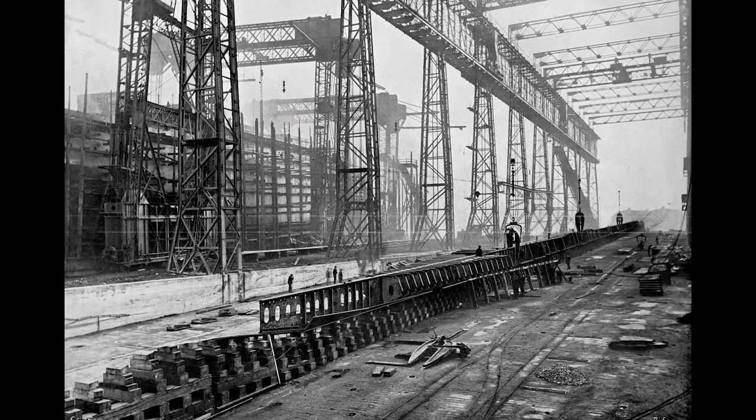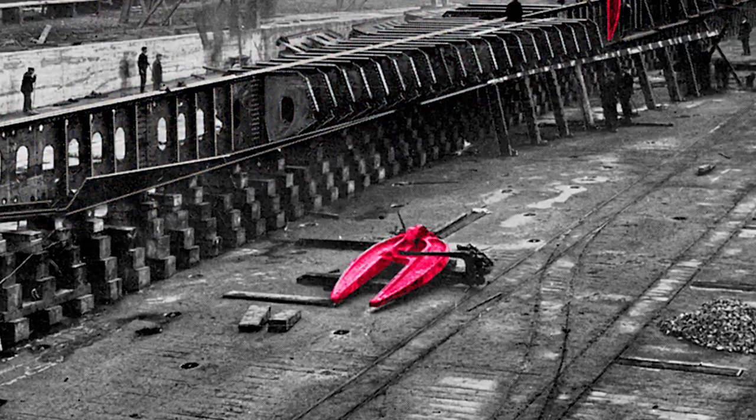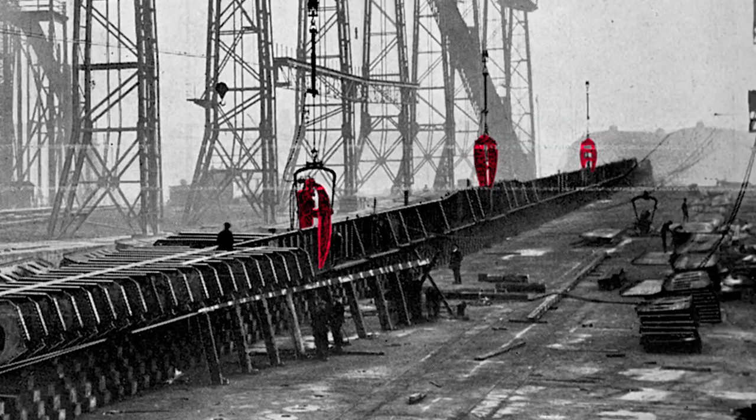So far we've watched the Olympic's construction. In the gantry, that ship sits here in the background. In the foreground lies the keel of its twin, the Titanic. Its construction began nine months after the Olympic. We see here, attached to the keel, the framework of the Titanic's double bottom. Notice this large claw-like mechanism lying on the ground and three more hung from the cranes — these are hydraulic riveters, which workers use to install most of the three million rivets on the Titanic.